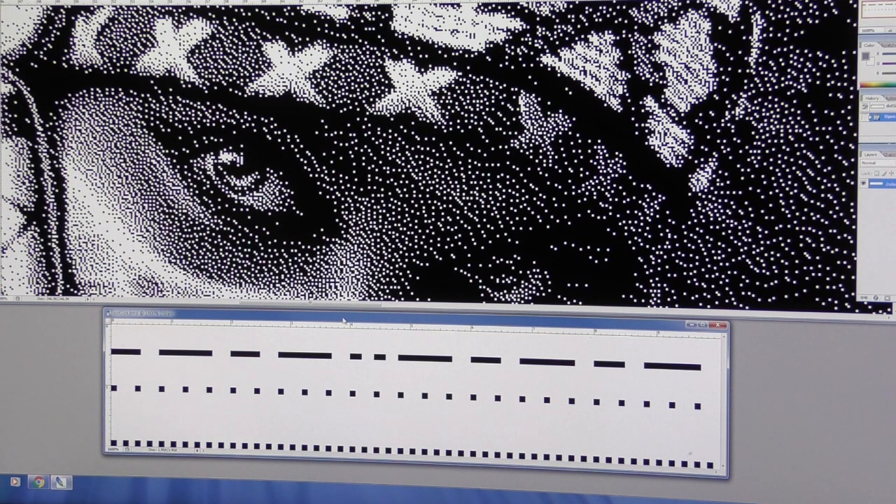If the dot you produce is bigger than the pixels, the ratio of black to white in the image will change - the picture gets darker because the dots are bigger and the amount of white becomes less, and your eye sees it as darker. That's the basic principle of how dithering fools your eye. I used this calibration pattern in the last video to establish the correct power and speed. Having done that already, I know I can get pretty good dots on the CO2 laser. The rule of photo replication: one pixel must be copied by one dot of the same size. Pixels do not overlap, therefore dots must not overlap. You have control of the black dot, and indirectly the white. Floyd-Steinberg is all you need.